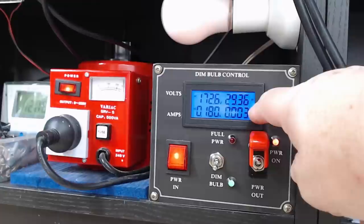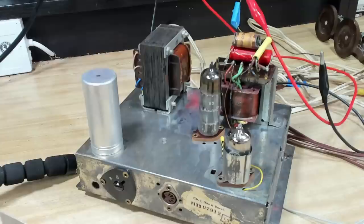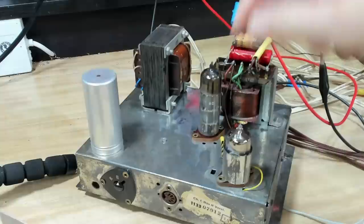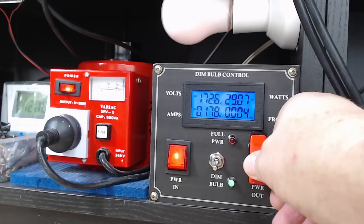It's been about five minutes now and the bulb's almost gone out. We're up to 172 volts and it's dropped a couple of amps - watts to about 29. It has got a bit of an odour; something's not happy. The selenium is there and that's cold. That bulb is warm, that one's warm, and it does make a noise. I'll turn it off.